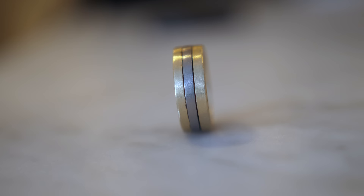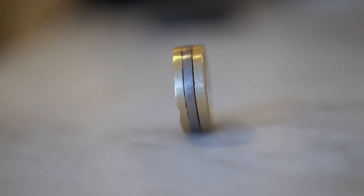On a scale of 1 to 10, how hard of a project was that? I'd give it a solid 9, maybe 10. It was a lot harder than some of the other inlays I've done where it's like antler or turquoise — some of these softer things. That's true because titanium is up there on the hardness scale — it's super compact and brittle. We had to be careful when we were bringing it down. But I think it turned out pretty sweet.